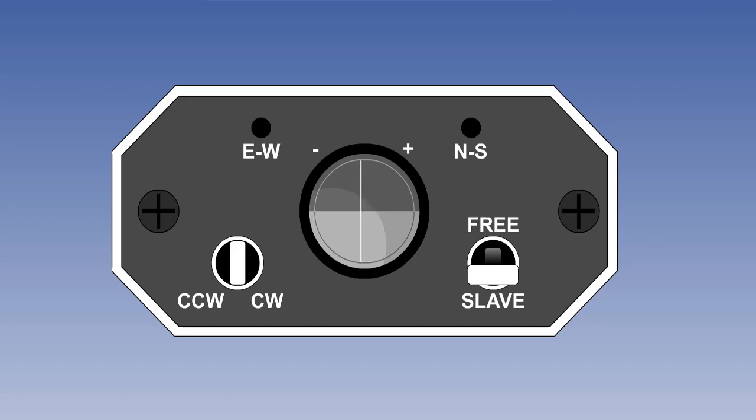The annunciator is useful to the pilot for 2 main reasons. It is an indication that magnetic monitoring of the gyro is taking place. It shows that the compass is synchronized. And on systems where it is necessary for the pilot to synchronize manually on startup, or after a desynchronization, it indicates which way to turn the compass.